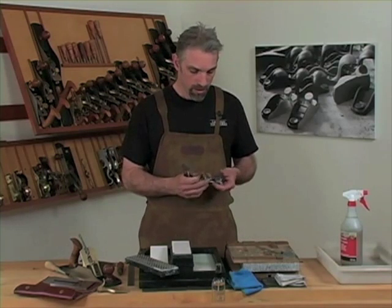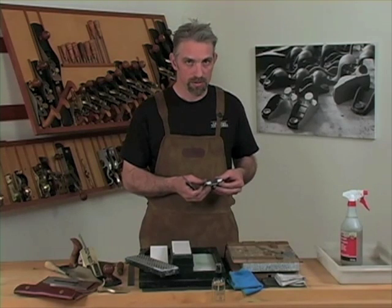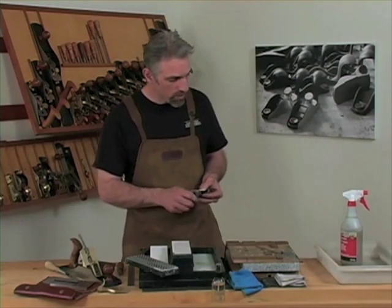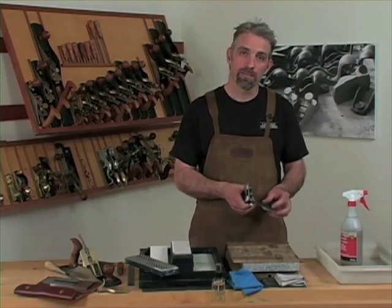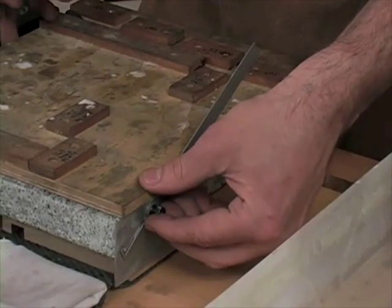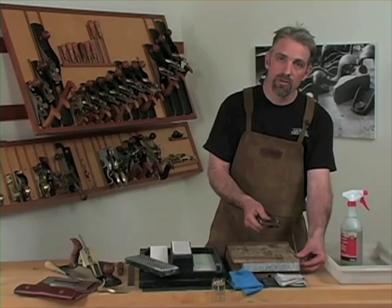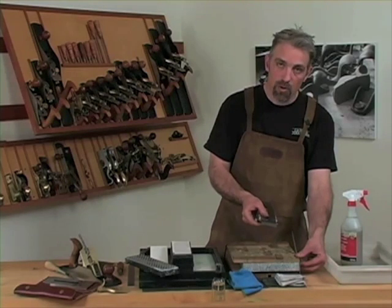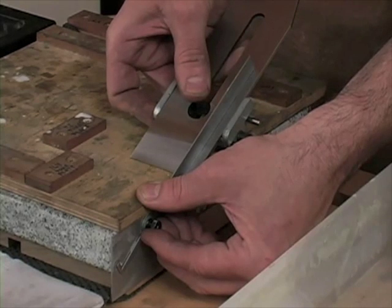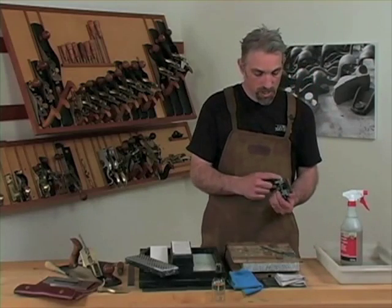If you're going to be using a different style of jig that may require different measurements for projection distances, or you simply want some different angles than the ones we've provided, set a protractor for the angle you like. Hook that protractor off the bottom of a parallel surface, like this plywood, which creates a fixed angle. The blade should shift in your jig but still hold position. Slip into that corner created, and when it intersects with the arm of the protractor, you've determined the projection distance for that angle.